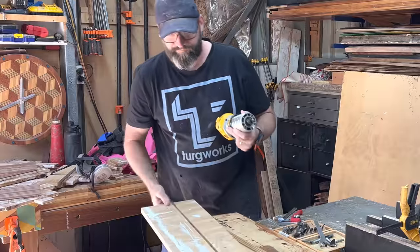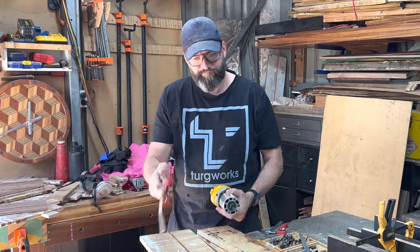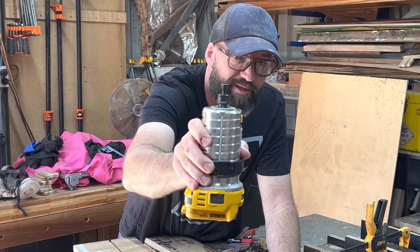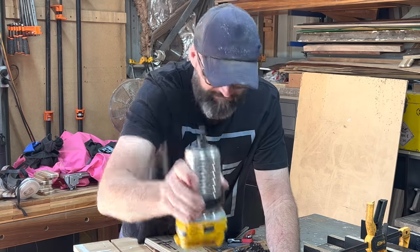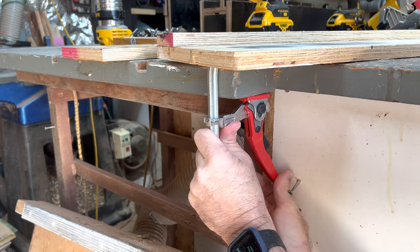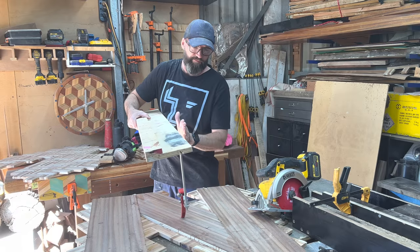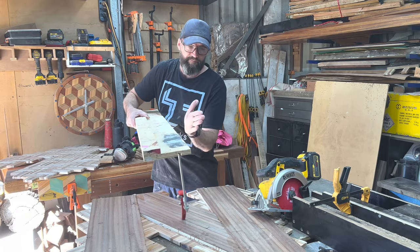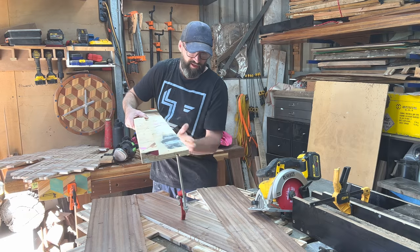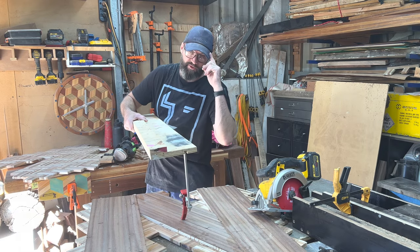Cut the channel that allows these clamps to slide in and pull up on that V using one of those router bits. I don't know the proper name, sorry. I think this is going to prove very handy. I've now got my little track saw. I can set these clamps up, match up this edge with the edge of the Z's, and then cut off the scrap underneath. So this plan has all worked in my head.